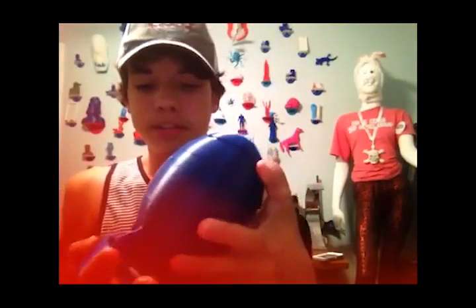But there is, I don't know if you could really see it, but there are a couple places that it did mess up from probably either overheating or under extrusion and stuff like that. But I did print this with the 1 millimeter, so there was a larger chance of messing up here. But then I printed this one with the 0.6 millimeter. So it is much nicer and more detailed. You can see the screw detail right there. And yeah, it just came out really nicely, and the time lapses came out really nicely.